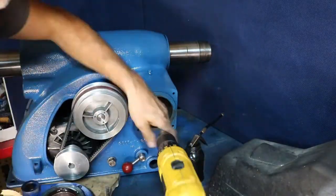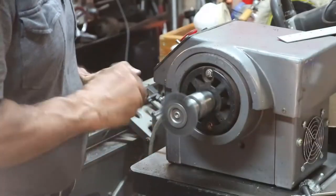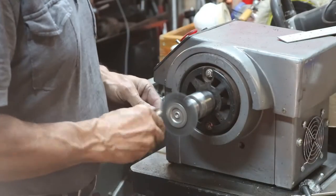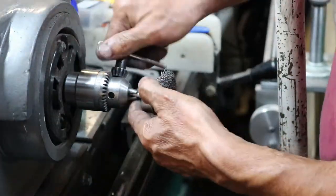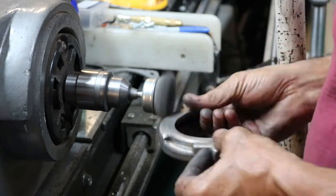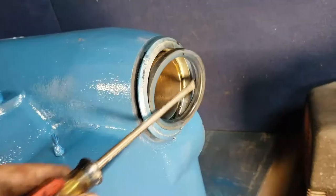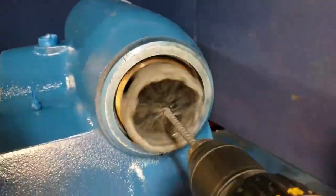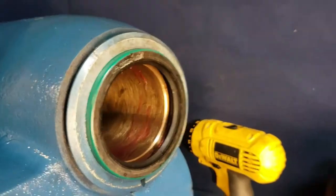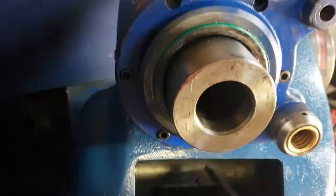Hone the cross-slide bore to make it smooth and ready to be lapped. With my treadmill motor wire brush, I did most of the cleaning and brushing. This machine ended up being pretty useful for this kind of work — variable speed, reversible, interchangeable with a Jacobs chuck. I love it. Now I'm removing the front oil seal, a little honing, and installing the new seal. After my gasket is ready, glued to the back plate, it's time for installation.